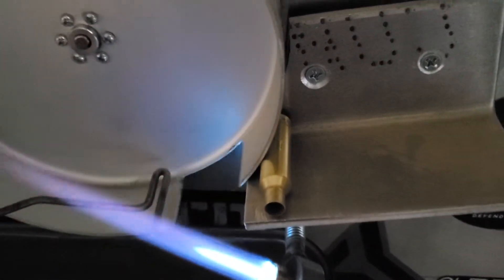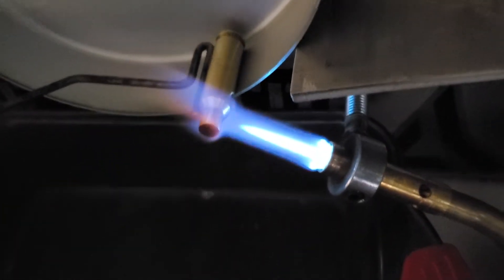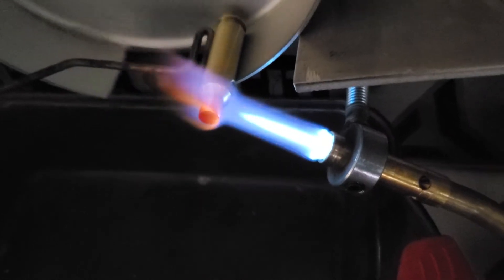It picks up the piece of brass — needs to be just a little hotter. See how that brass is turning red? That's overcooked. You're making the brass thin and not accomplishing anything.